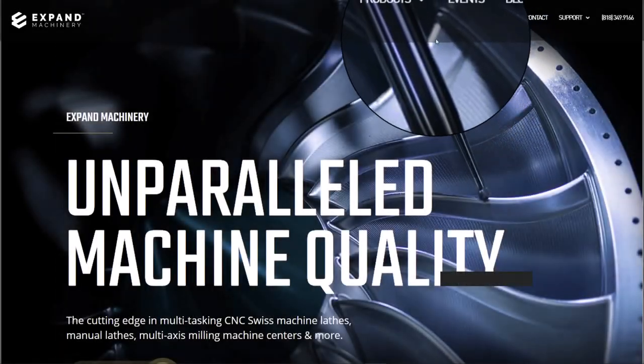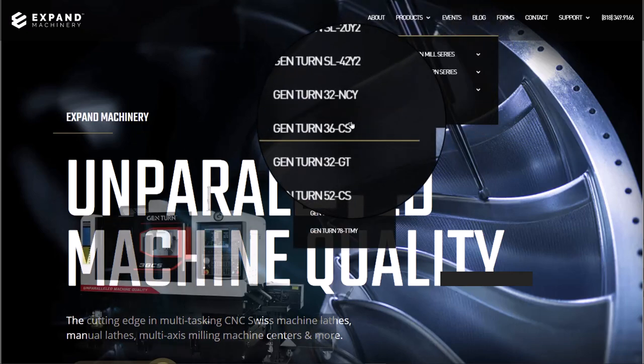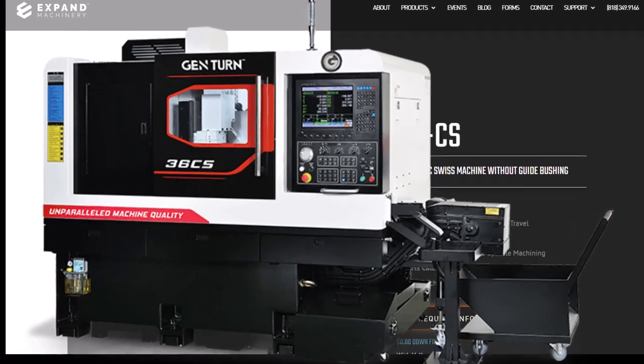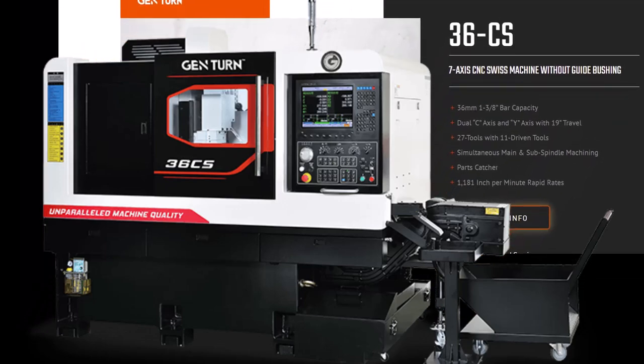Are you looking for an affordable way to run up to 70% of the Swiss jobs that do not require a rotary guide bushing or ground stock complete in one operation? You have found it in the 7-axis 27-tool Swiss-style GENTURN 36CS.